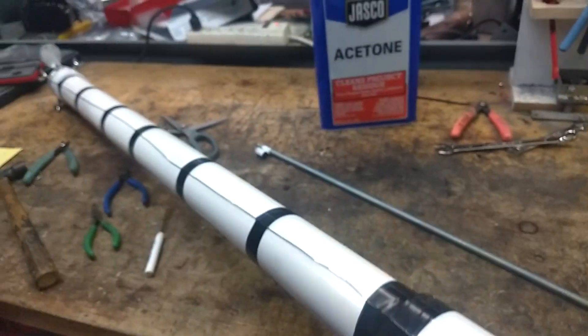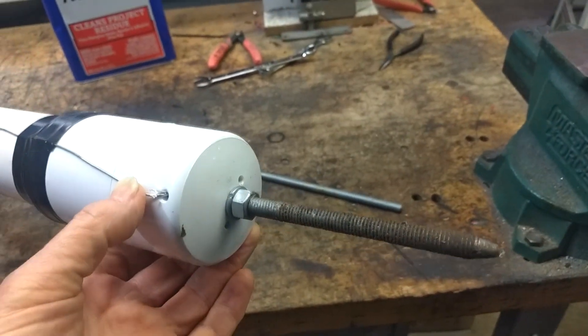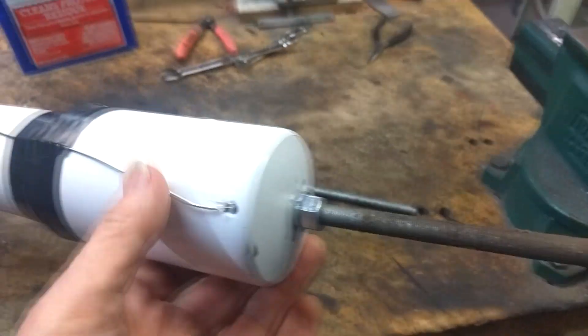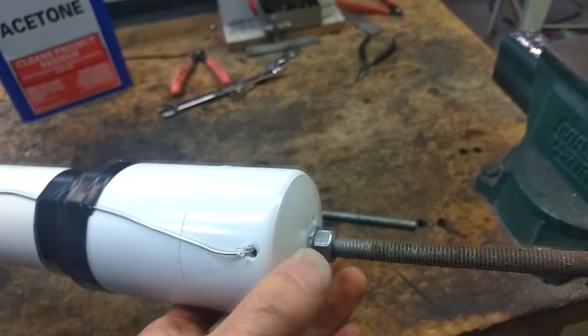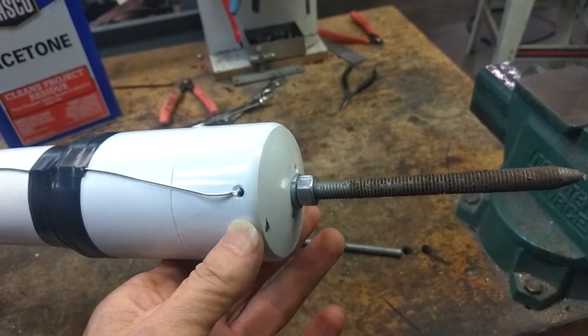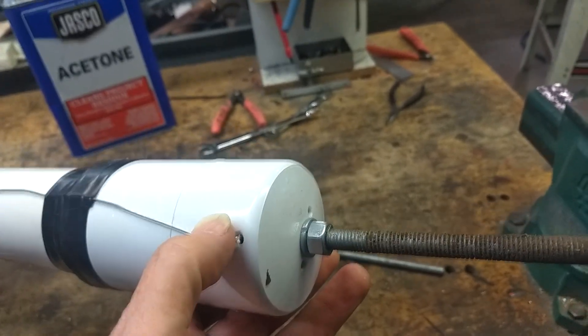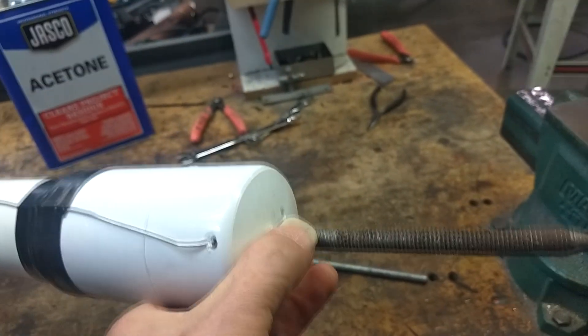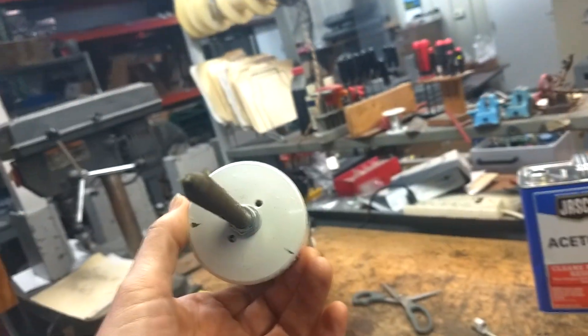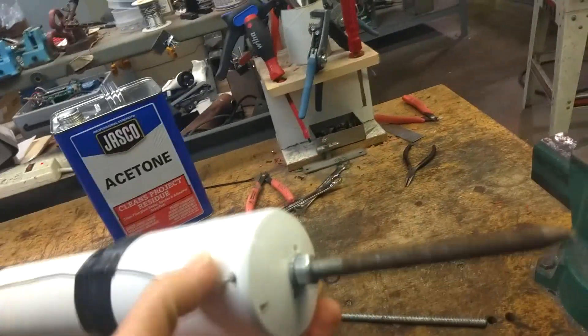Here are some details on the ends of the PVC pipe that holds the fiberglass mast. The spike is made out of regular all-thread — this is 3/8-inch all-thread at 16 threads per inch. There's a nut on the inside of the pipe cap attached to the stud and one on the outside. My connection wires go through here and attach on the inside so they're not exposed to being jammed into the dirt all the time. There are also weep holes in the bottom to let any rainwater out that might accumulate.